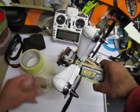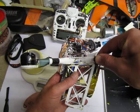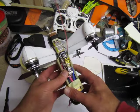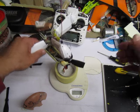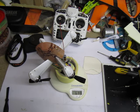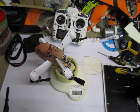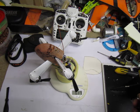Another thing about the structure: on the other one, crashes caused the battery holder part to start coming out, cracking, and needing gluing. With this one I went straight through the sandwich frame and right through it, so this one shouldn't fail like that. Now, important weight: this one, ready-to-fly weight, is 637 grams, compared to the V2's 800-something grams. So nearly 200 grams saved — a bloody large saving, even though the motor is a little bit smaller.